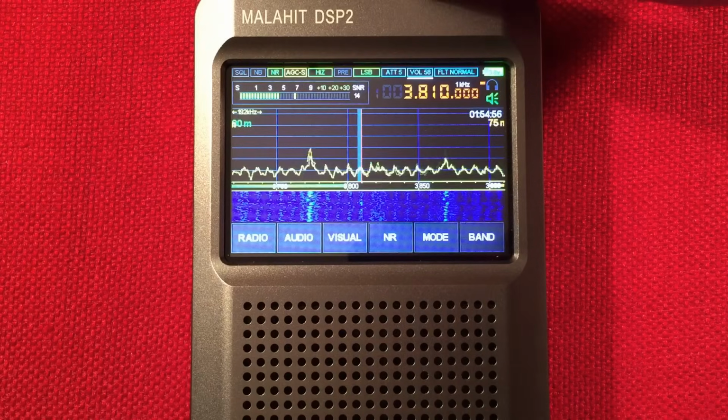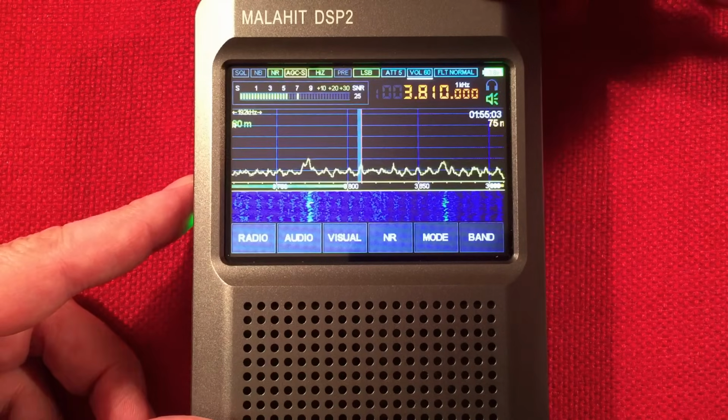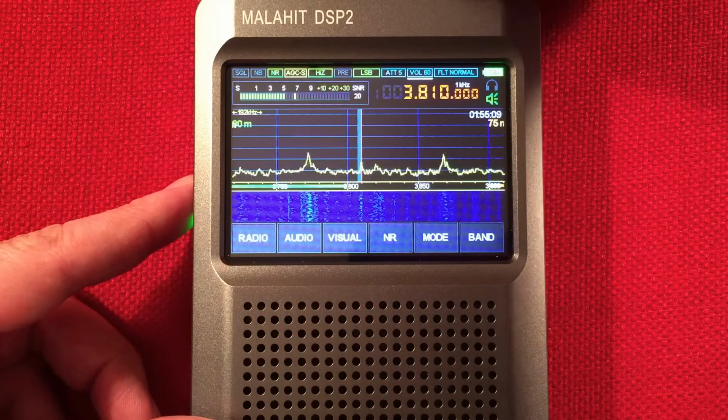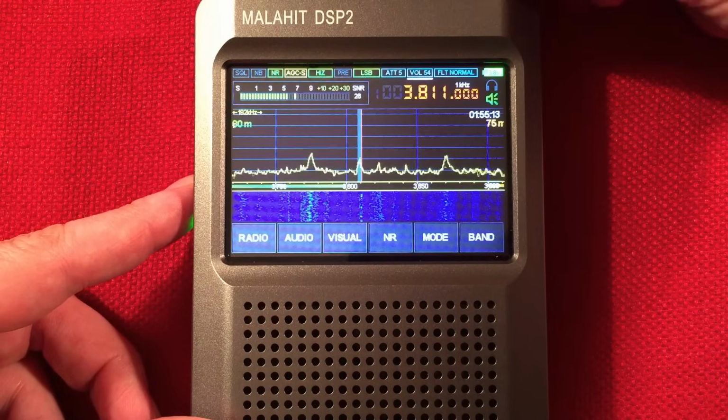One thing that helps with a VFD is if you put your wires together, because that basically creates some cancellation in there. Same as like if you're doing the circuitry in a guitar amplifier or something, on your circuit, you want to twist those wires together.